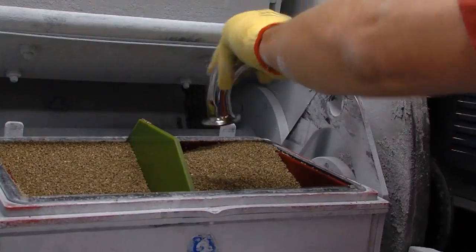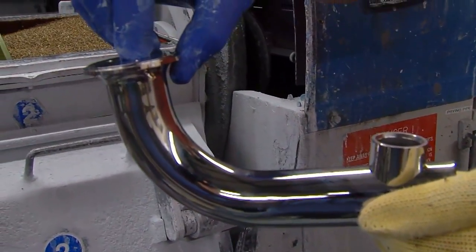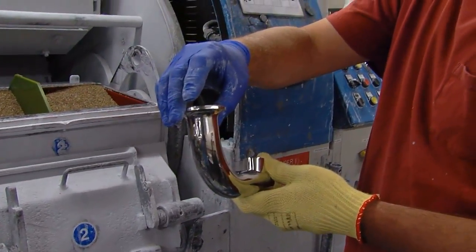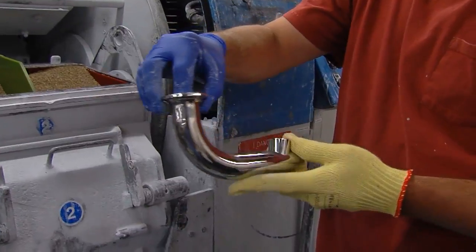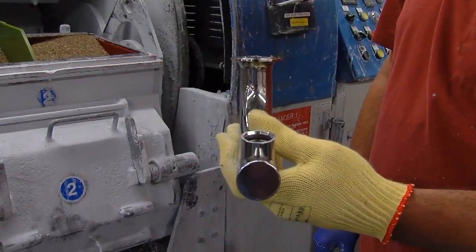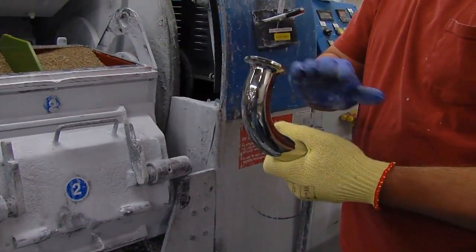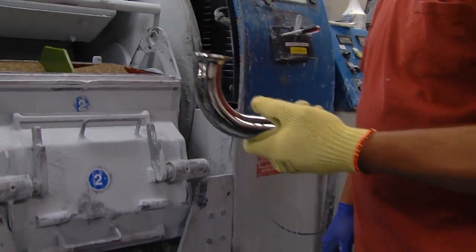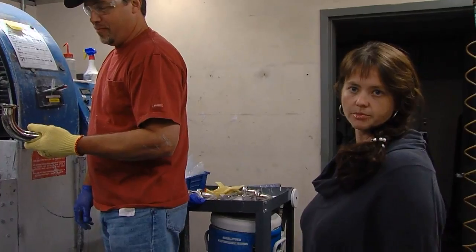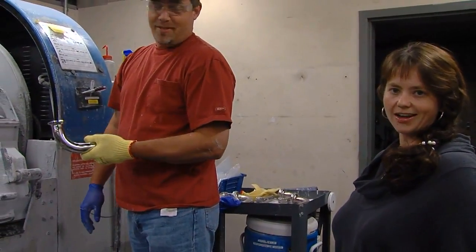Parts do get hot in the corncob process. We don't have to have it capped because it doesn't remove any material. That's a final piece — there's no more work to it; we can ship it after washing. It spends about an hour in the machine and takes about 15 minutes to change over, but then Brad can walk away and go do something else for an hour while the machine is running and polishing it.